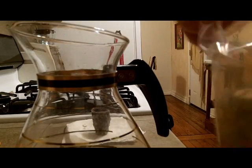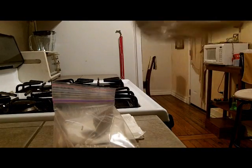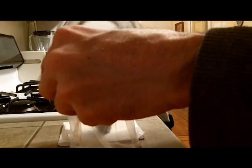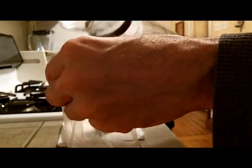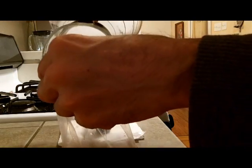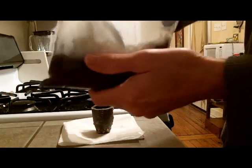You want to get all the gold you possibly can out of your one run. Here's what I'd recommend — simple as a plastic bag. I'm going to try and drain as much gold as possible in the fluid that's in here and pour it quickly into the bag. I'll add a little bit more distilled water, just rinsing it all out, open the baggie up again, stir the distilled water in there real good, dump quickly, make sure you get all the gold out of there, and do it again with a little distilled water — just washing out the vessel into the bag.